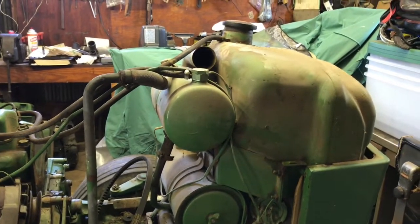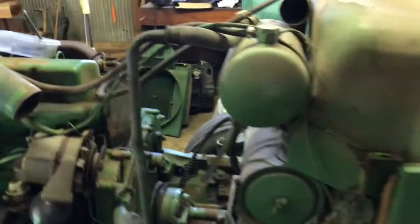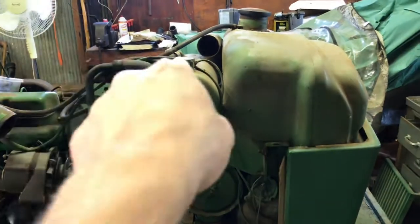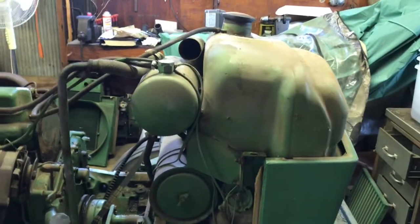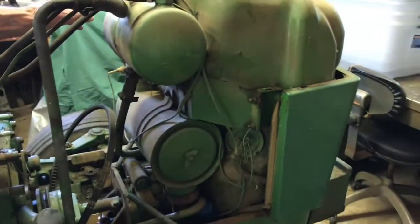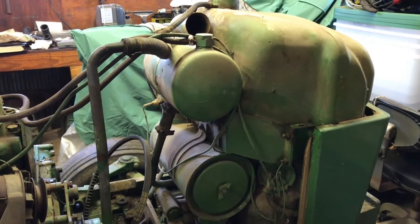As a troubleshooting step — if you don't have hydraulics, you could check to make sure you've got flow into this reservoir. If that pump fails or the pickup fails, you would not have any flow on standby to that tank, so checking that is something you can do in troubleshooting.